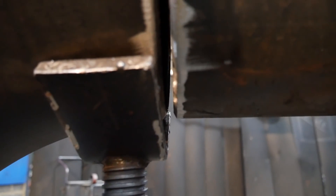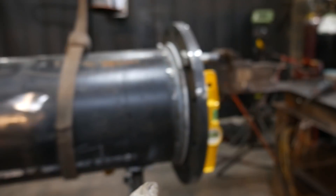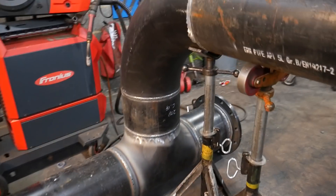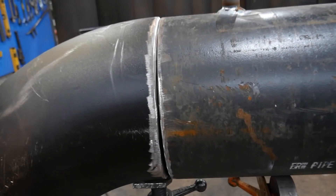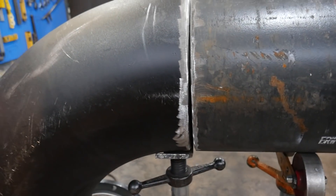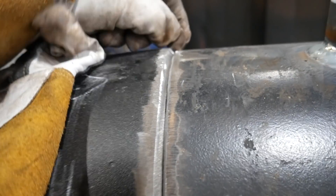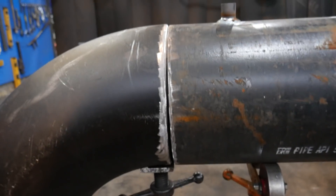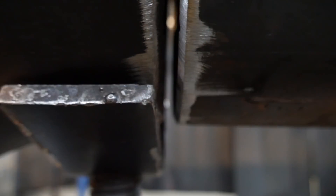Right now this here is worst case scenario — I have a gap underneath of almost 10mm and coming up to the top there's no gap. Measuring from the face to the pipe underneath, it's 10mm too long, so I'm going to have to pull this piece away and shape it back. I don't like doing that because when you're doing a positional you want to keep your prep even. Both sides were machine prepped, so somewhere along the line I've either done something wrong or the fittings aren't perfect. I need to prep it back to get a small enough gap.